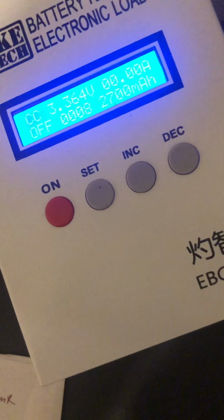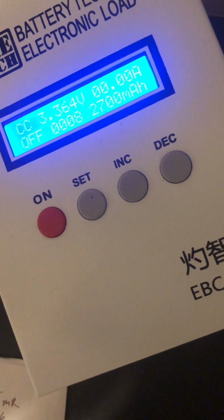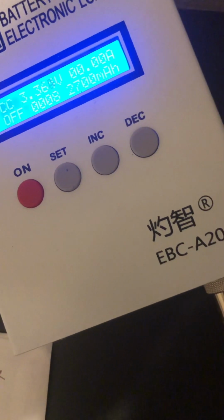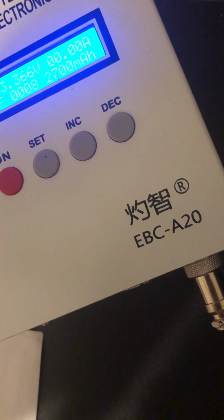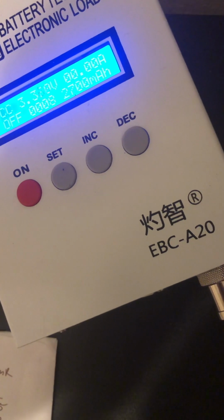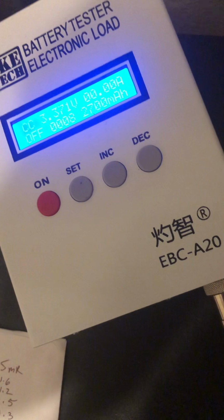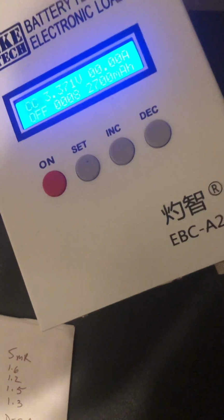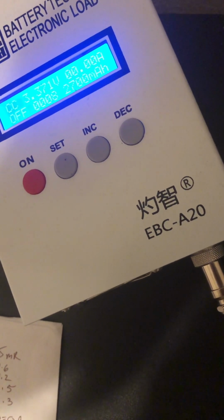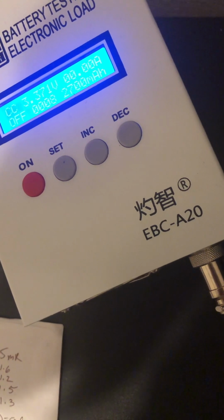So there you go, guys. Liito Kala, they don't have cells that can do this. I'm sorry, they do. In the 32700 size, they do. 18650, 21700, they bullshit all their ratings. The number that's printed on the wrap, that's the pulse discharge rate, and that's usually exaggerated. The capacity, that's usually exaggerated too. Those 32700s, they don't test for 7,000 milliamp hours. They test for like 6.